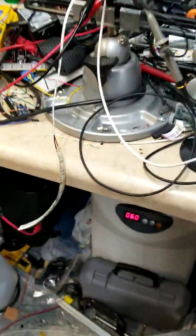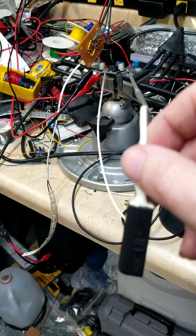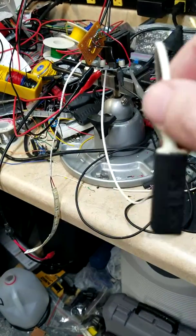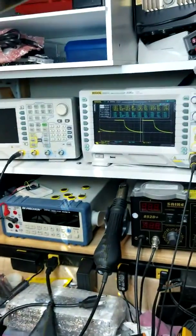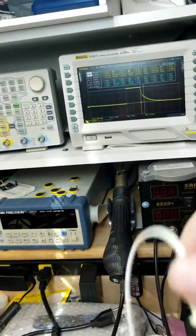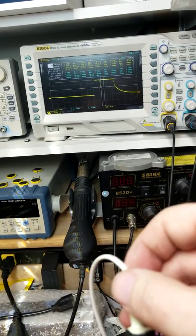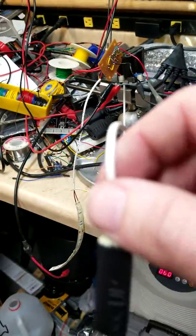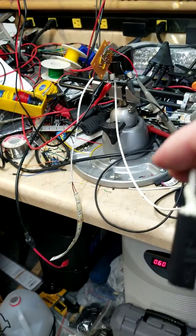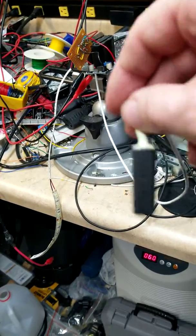What's interesting to see is I'm going to shake this, and you do see an occasional signal. If I shake it a lot of times, it's allowing the rail to stay high. But typically you're going to hit one bump — and as you can see there, you're not seeing the light come on. But on the oscilloscope, every time I shake it you're seeing that go high. If I shake it a bunch of times, because of the way it decays, the power decays down, it's going to allow that light to come on. I could increase the time of that, but I don't want a big long delay when I open the trunk of the Goldwing, so as you can see when I shake this, it's filtering out most of them.